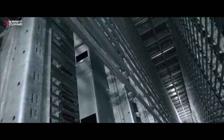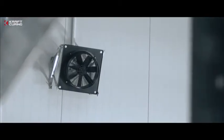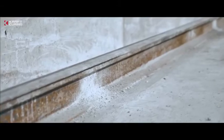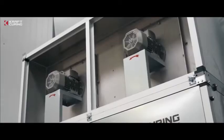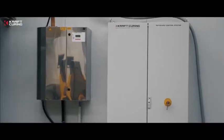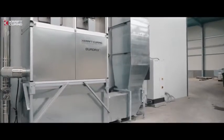The success of Quadrix is down to various design elements, including multiple vertical air distribution ducts for accurate distribution of warmth and humidity, air circulation ventilators to prevent fog in the transfer car area, and exhaust hoods over the entry and exit with heated surfaces to prevent heat loss and condensation. In addition, the main equipment is located outside the chamber, including the Quadrix air circulation and heating unit, the autofog humidity addition system, and the electrical control cabinet.